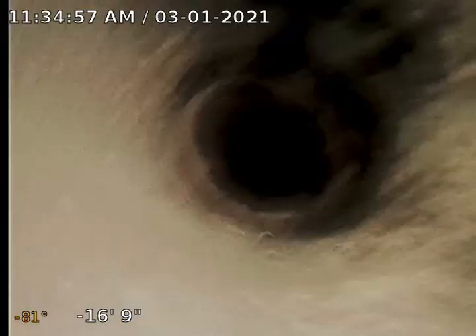Point of access is a 4-inch cast iron roof vent. We're going to be checking the serviceability of the sewer line from the bottom of the vent stack out towards the street. Currently in the horizontal position, so we're going to zero the footage meter out and proceed out.